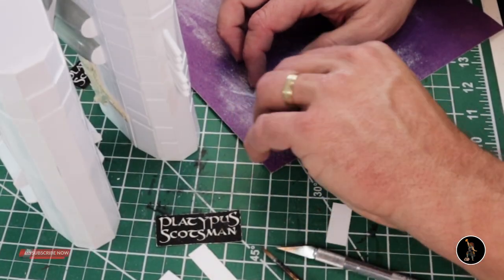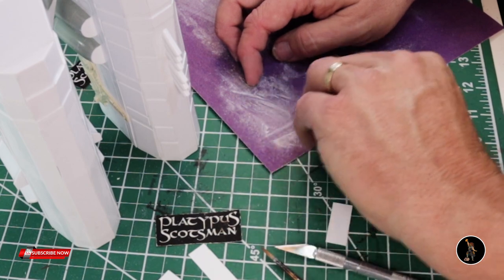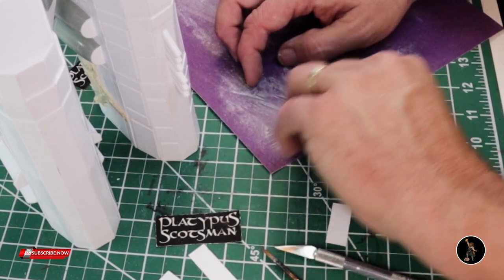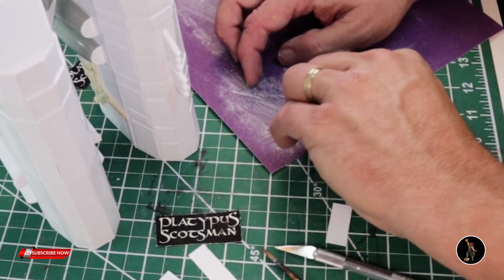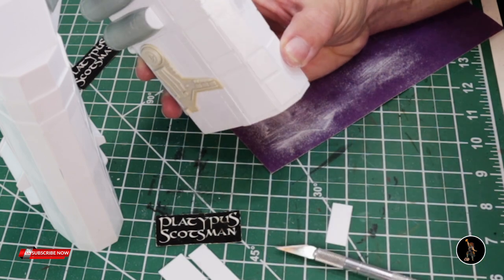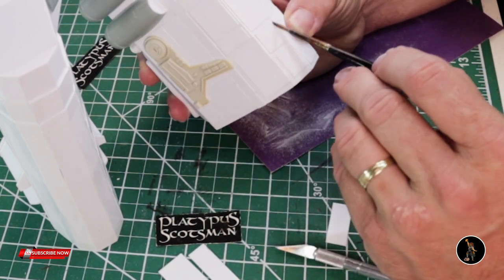On the paneling, what I've discovered I like to do is bevel all the edges that are showing outwards. In other words, take the crisp edge off that you cut and just kind of lightly sand all of them — all four edges to a 45 — unless you're going to butt up against something else. And even then I do that too. I don't do it on everything, but most of the paneling I'm doing that on. I just think it looks better. It also catches the light a little bit better. And then just glue them on.